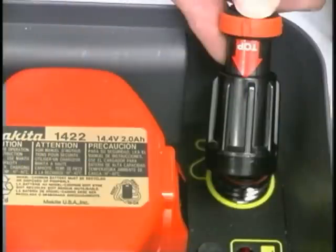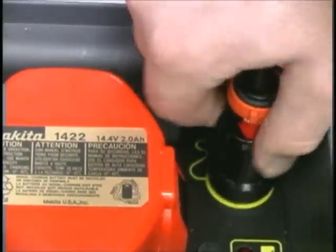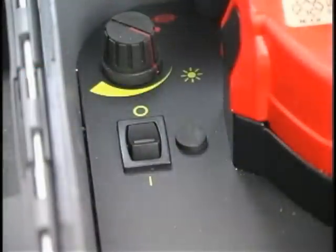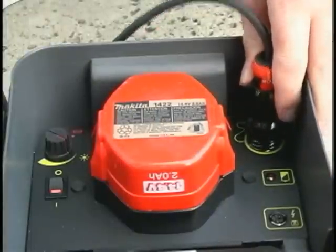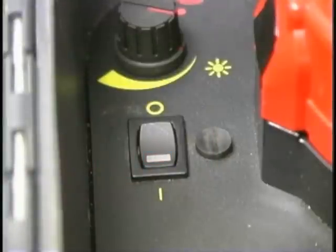The camera's interconnect cord plugs into the matching connector on the Toolbox Monitor. Orient the connector so the arrow is facing toward the monitor, push it in fully, and tighten the locking sleeve. The power switch glows steadily when the power is turned on and the unit is receiving a good signal from the camera. If the camera is not plugged in or there is a problem with its connection, the power switch will blink in an SOS pattern.